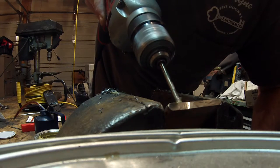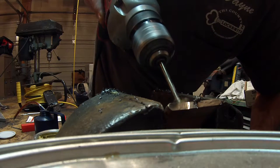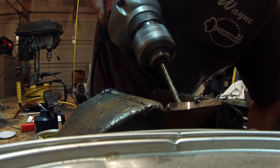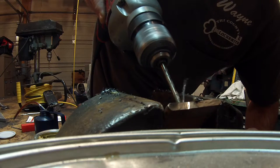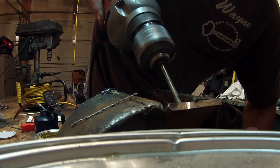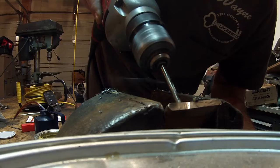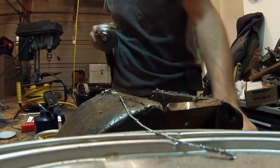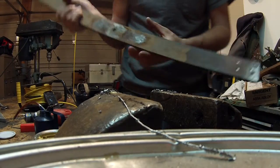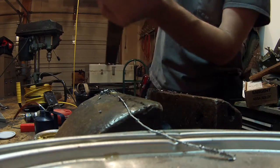Notice I'm also doing this with a hand drill — this isn't in a drill press. This is actually just a hand drill and a vise right here. You can see we're getting a good spiral edge off of it. And we're through. You can easily see that that's a leaf spring off a heavy duty truck, and you've got a hole right through it right there.